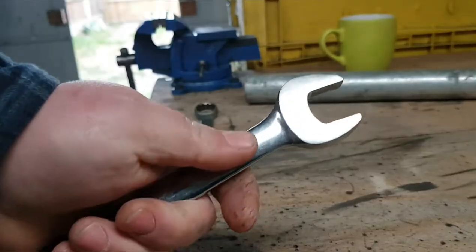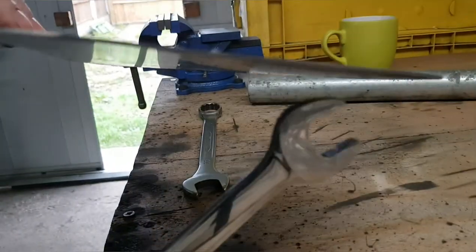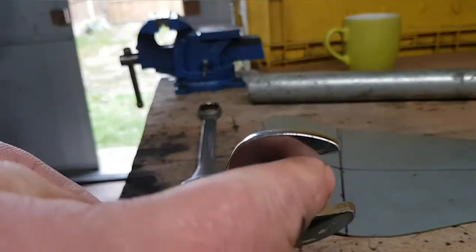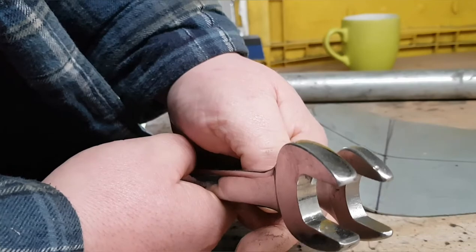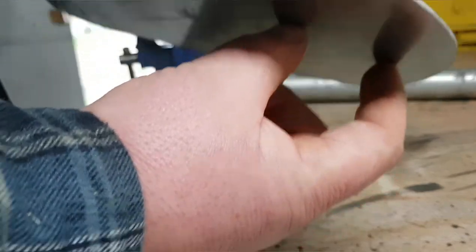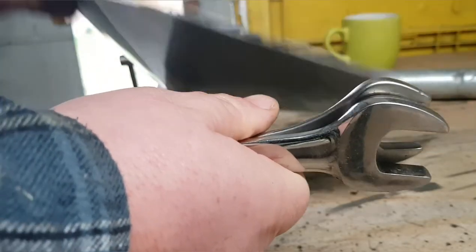So I'm looking at cutting the spanner at the right size, at an angle, and having it so it sits up off the plate like that, with the seat on it like that. Then what I'm looking at doing is putting nuts — welding nuts into the end here. I'm looking at two, so they will be pretty close together like that, with nuts welded in both. Then on the bottom of my plate here, I'll weld just a bracket or something that will sit like that, with a hole in it that I can bolt straight through, one bolt through the bracket on the seat.